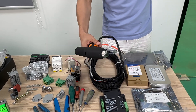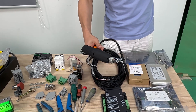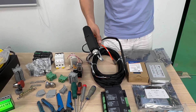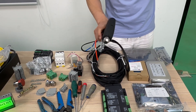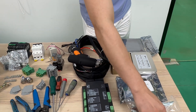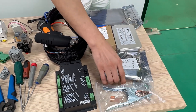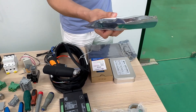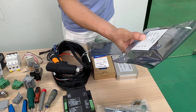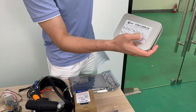And this is the laser welding head. The laser welding head is where the action happens — it focuses the laser beam on the welding point to melt and join materials. And this is the negative electrode clip. And this is the lens, including protective lens and some monitor wire. And this is the nozzle — you can see different types of nozzles.